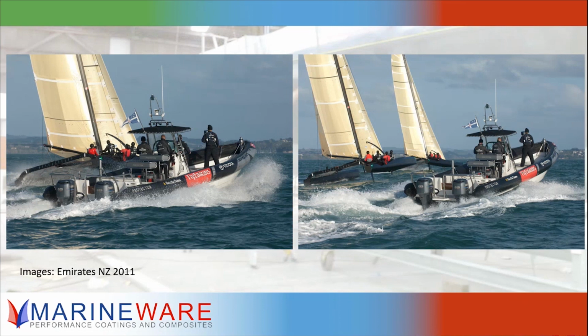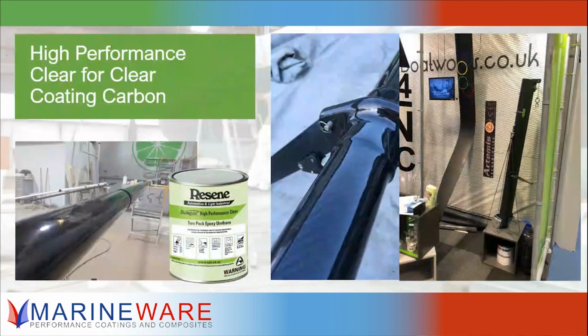Yeah, I use that quite often because quite a lot of people like to get a bit of a shine on their foils towards the end, particularly on yacht foils. They seem to like them shiny rather than matte. But then it's the age-old question: because you've added clear into the Durepox, is it a bit slower? The other thing you have to watch out for is that the overcoat time with Durepox primer, I think, is 72 hours wet on wet without sanding if you want to push it that long.